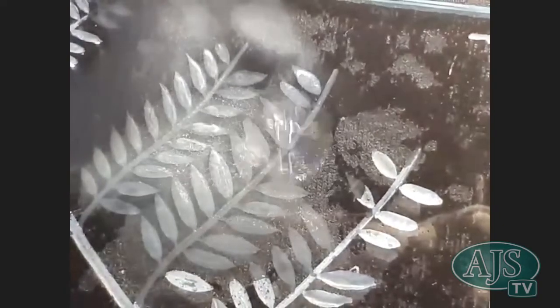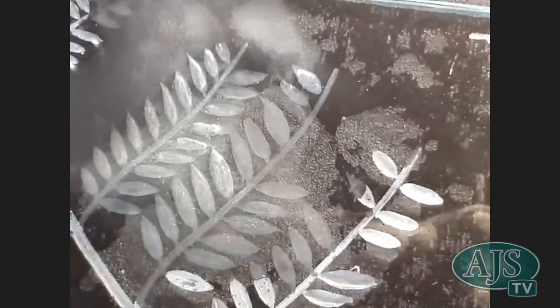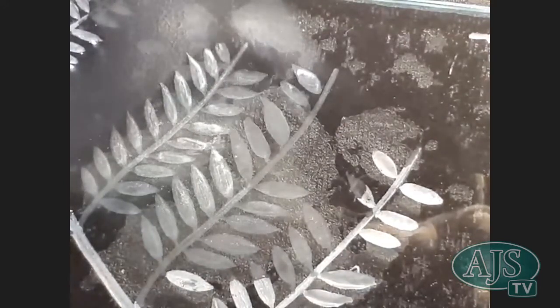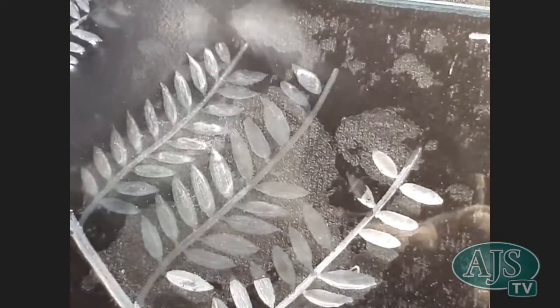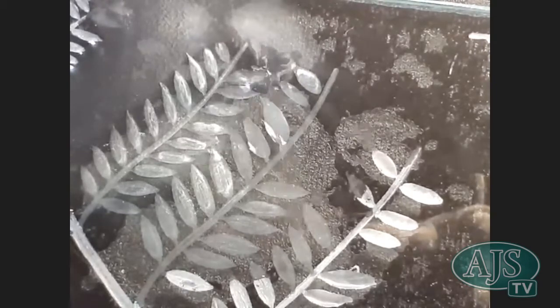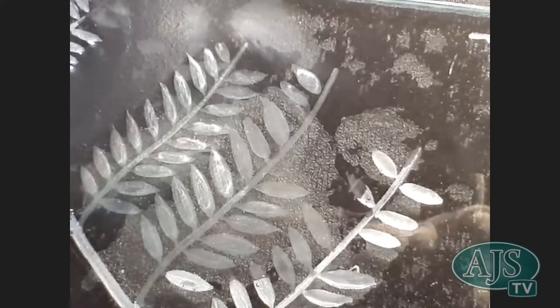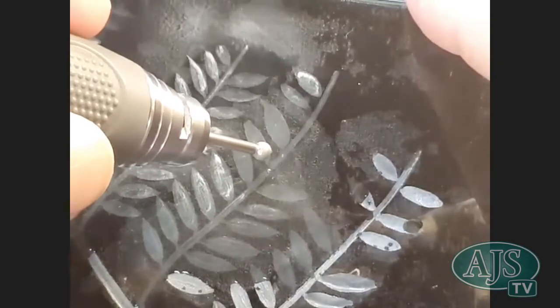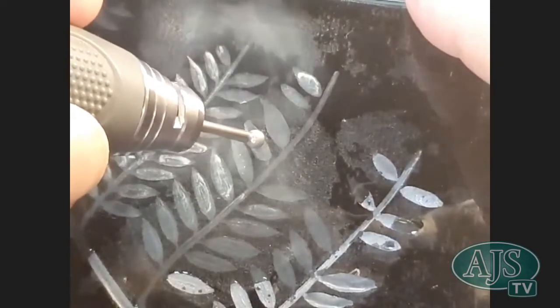And so that's kind of created my shape. It's a little bit hard to see in the video, but it's kind of a bit flat and also somewhat rough as well. So if I wanted to sort of polish that up, I'd end up with sort of polished ridges and rough troughs. So to smooth that out, I'd just go to essentially a larger burr and sort of just smooth it out a bit more, just sort of try to make it more like a consistent cut.